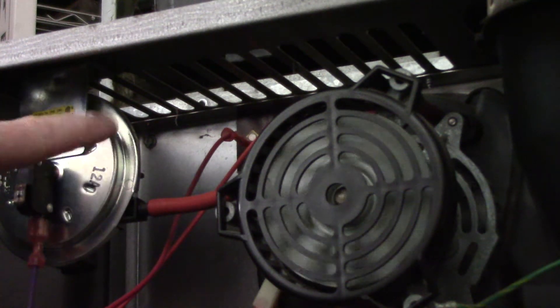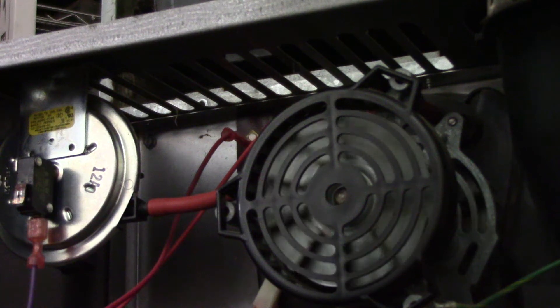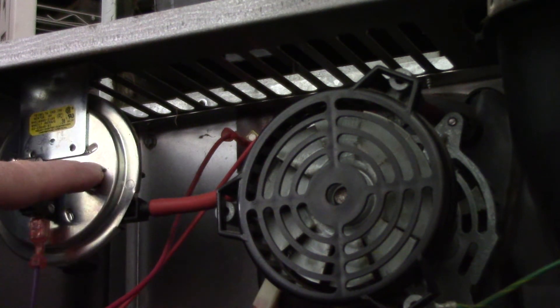There's something obstructing the inducer motor from allowing the vacuum to close that pressure switch. These are negative pressure switches — they close when the pressure is negative, not positive. The inducer could not run; if that was the case, you would still get a code saying 'pressure switch stuck open' because the inducer is not running. You, as the person who troubleshoots, has to figure out why it is giving the code for not closing.